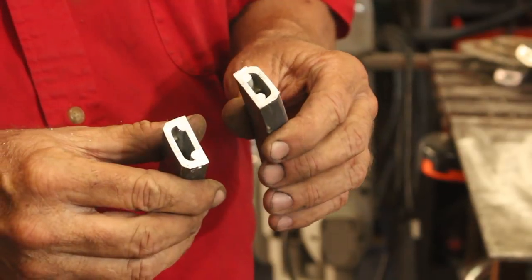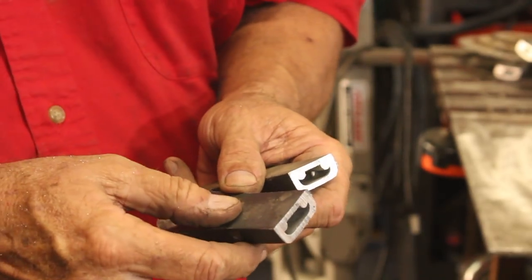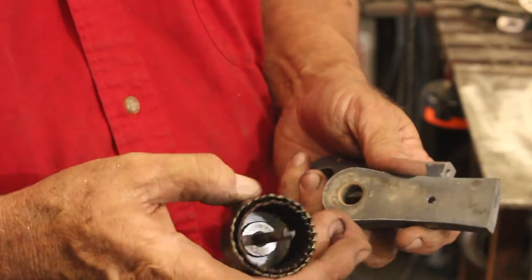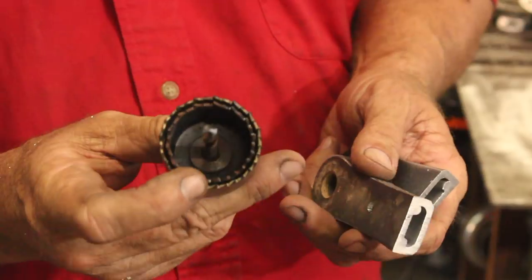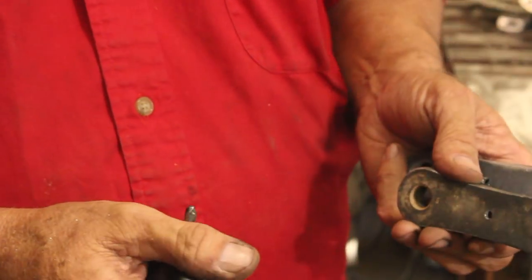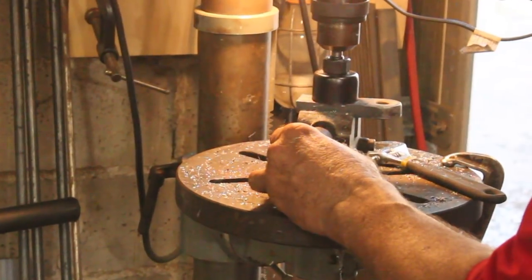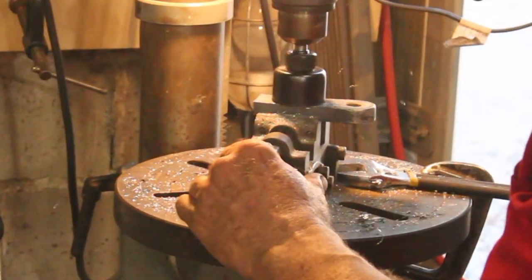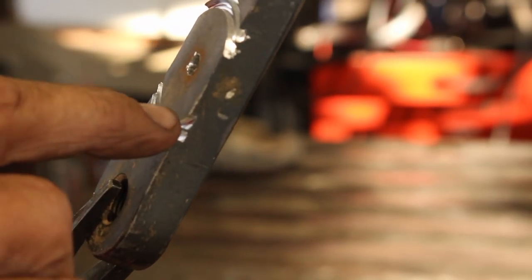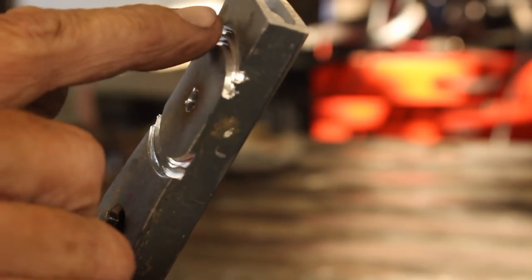Something I didn't realize is that these cranks are hollow. I'm still going to try to use a hole saw to cut a circle in there to mate up to the bottom bracket, then use a friction fit to hold it in place. I've cut these both off and drilled a pilot hole through both of them at the same time. Now I'm going to come through with a double-stacked hole saw and just drill right on into it until I leave a score in there that's deep enough to seat into the bottom bracket. What we've got here is two deep grooves with a piece in between, and overall this is just about the right size to squeeze onto that bottom bracket. I'm going to have to manually chisel out that raised spot in the middle between the two grooves.